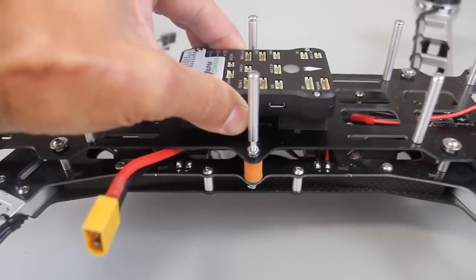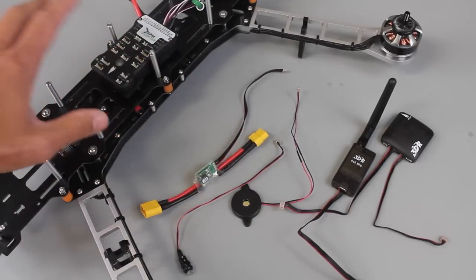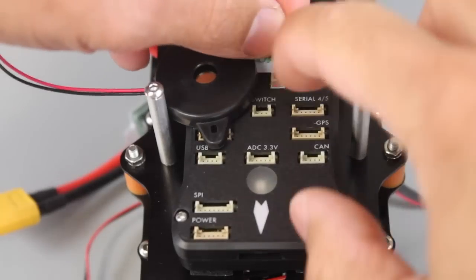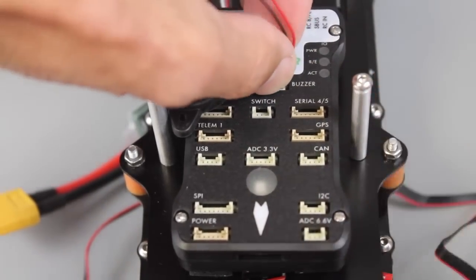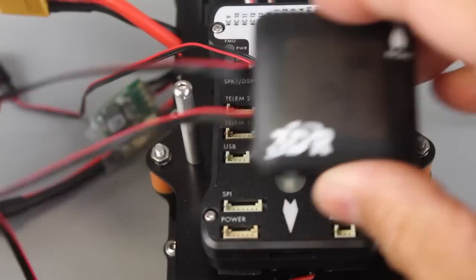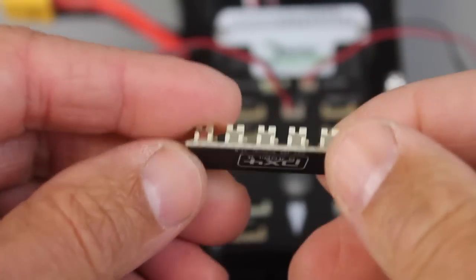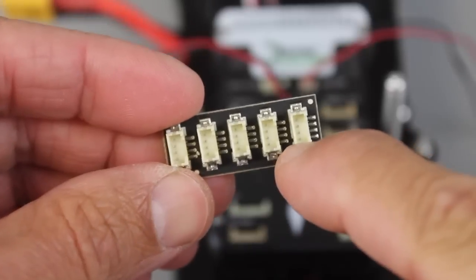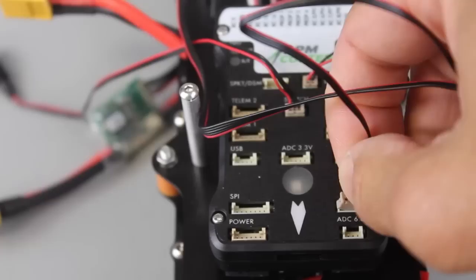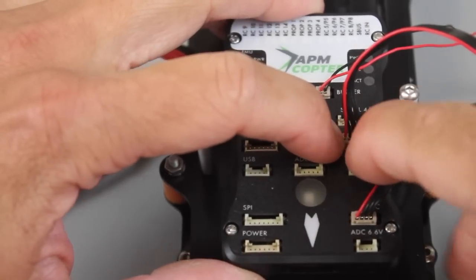Those pads have a lot of stickiness and hold to them. Next thing I normally do with Pixhawk is get everything plugged in. There are about six connections here that will plug into the top of this flight controller. I like to do that just so I can get orientation and understand the cable distance to know where I'm going to put the different components. Let's start with our buzzer - just two pins, it goes into the appropriately labeled buzzer port - and our push button switch that will go into the switch port. We're going to connect our GPS and compass: GPS will go in the GPS port and compass will go into the I2C port. Pixhawk does come with this I2C splitter, so if you were going to use another device you could plug your compass, LED, or even an airspeed sensor into here and then have this plug into the I2C port on your Pixhawk. For the sake of this build, we're going to plug the compass directly into the I2C port on the Pixhawk. Now we'll plug the GPS in.